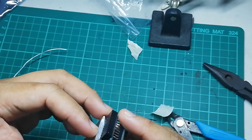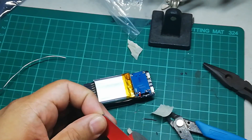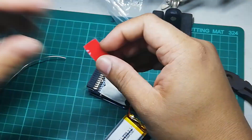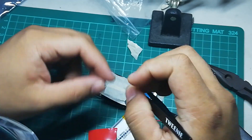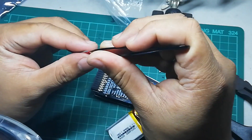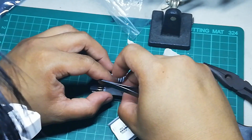I'm bothered by the battery situation. The pins for the ESP8266 are a bit long and are sticking out quite a bit. Since the battery sits on top of those pins, I'm worried they might puncture it. My solution is to add double-sided tape to cover the pins, which also helps keep the battery in place.